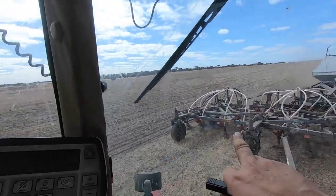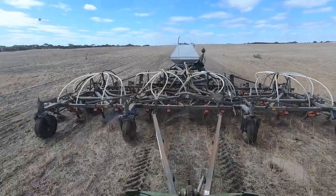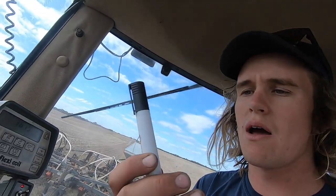For a start, each tine is making a furrow — that's what I call where the seed goes. The seed trench is a furrow. On this bar I think there's 42 tines or something like that. As you go along they make a furrow, so I'm going to figure out in every hectare what the distance of furrow there is. This will also be different for yours — if you have different spacing it will be different, but if you have the same spacing it will be the same per hectare. Anyway, let's start. Right here I've got my whiteboard marker.